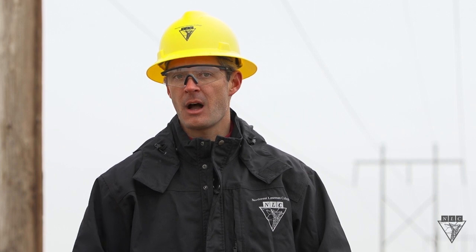You may have noticed that birds rarely land on transmission lines. This is because the corona irritates their feet, making it uncomfortable to land on the line. Also, this is why workers doing live-line barehand work use a wand to bond onto the conductor as well.